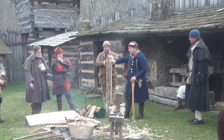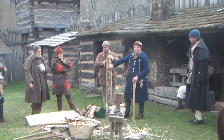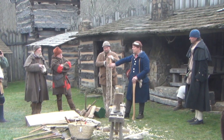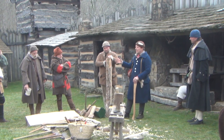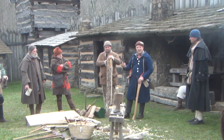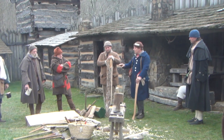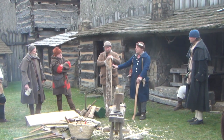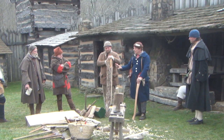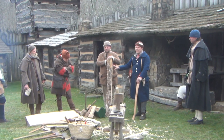If you still have some healthy ash trees, and you want some handle material, I would suggest get them taken down before they're stone dead. This tree still had green leaves in it. Once they are totally dead standing, the wood will have a quality called brash to it, and it's brittle. So if you have a chance, get yourself some ash, split it into some billets, put it in a dry place, and use it as you need to, because it will go the way of the chestnut tree.